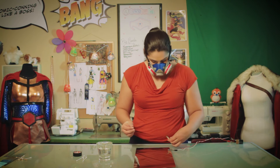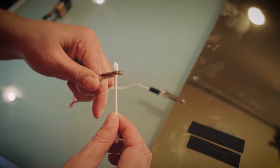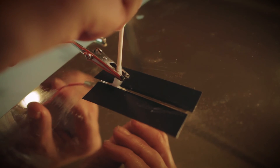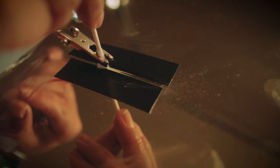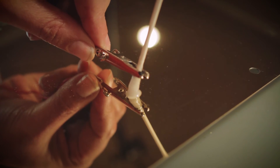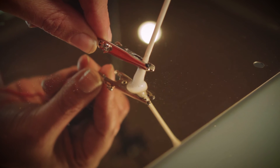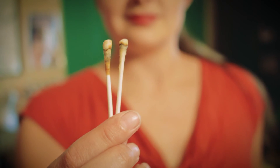The next thing you're going to do is grab one of your Q-tips. You're going to dip one end of it into your salt water, and then you're going to clip the positive alligator head — which is my red wire — to the wet end of the Q-tip. Make sure it's in the water; if you clip it to a dry part of the Q-tip, this will not work. Then you're just going to go ahead and rub it along. You want to make sure that your electrical tape, nail polish, vinyl sticker, or whatever else you have there is completely sealed to your metal. There's a little bit of fizzing happening. If this chemical reaction isn't happening, you might want to check the composition of your metal or see if there's some sort of coating on it. You might want to use rubbing alcohol or some light sanding to get through the protective coat. You can also tell it's working because you'll get rust colors on your Q-tips.